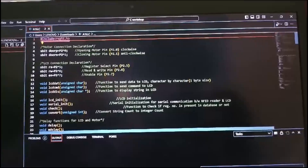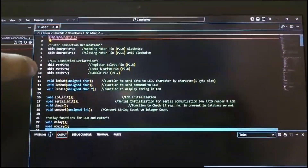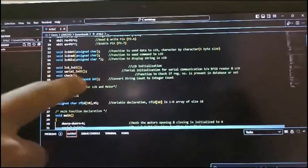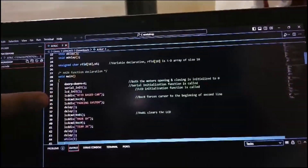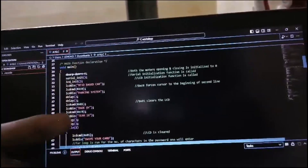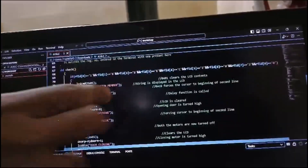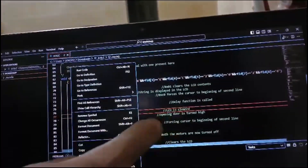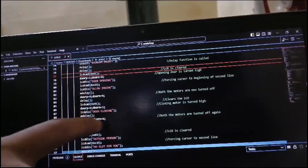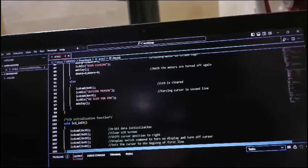I am Kedar Mojabdar. The code includes the REG51 header to work on the microcontroller using C language. LCD display values are allotted — it shows the RFID tag number, prompts the user to swipe the card, then displays the name along with the RFID. It then tells the user to go inside, the door closes, and a parking slot number is allotted.